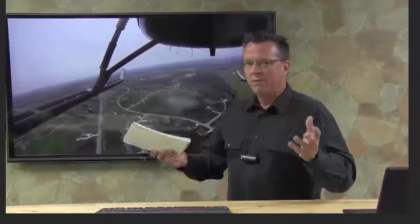Next, I want to explain to you how we do the throttle. Again, this may vary on where you're flying and how your instructor wants to do it. But what we did was we enter it, roll back a little bit just to split the needles to make sure we're in an auto rotation. And then if we liked it, we'd go ahead and roll the throttle all the rest of the way off. We wouldn't chop it. So that's our method on how we do it, and that's the way I like it. If you enter it and it was kind of sloppy and you want to recover early up high when you still have 400 feet or 500 feet, no big deal.